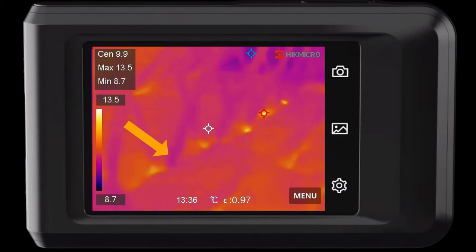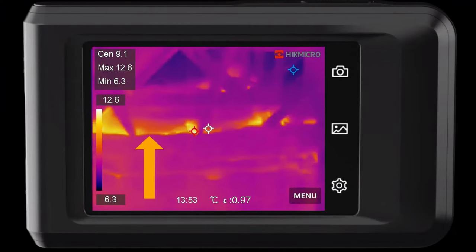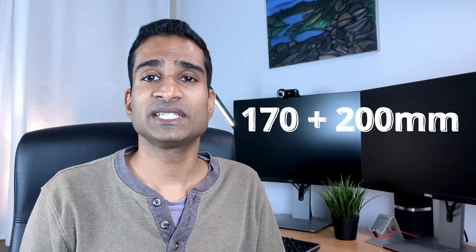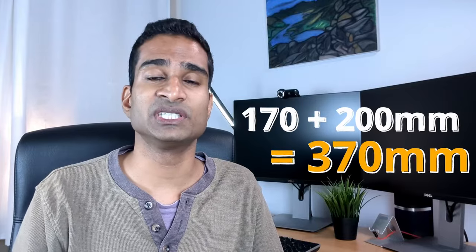You can see these areas here where the rolls of insulation lay next to each other, and these wooden rafters acting as a thermal bridge. In this video, I'm going to show you how we went about adding another 170mm to our existing 200mm, taking it up to a total of 370mm of loft insulation thickness. And at the end, I'll show you the thermal images before and after adding this extra loft insulation.